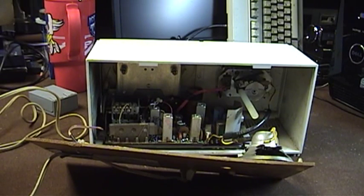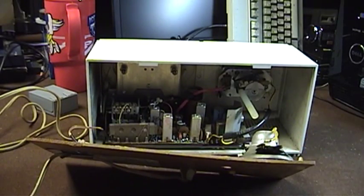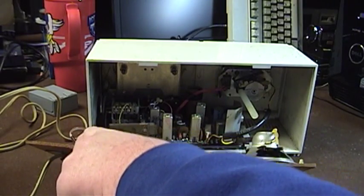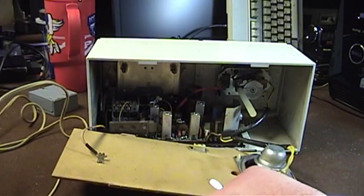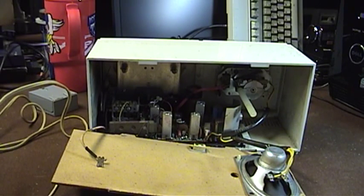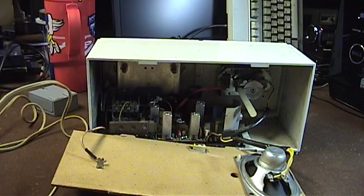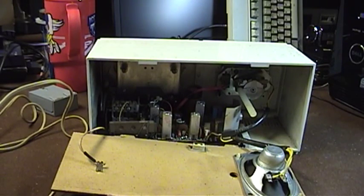I'm back, and I have just finished removing the rear cover of this radio. You can see the speaker stuck to the back here along with the plastic rivets that hold it in. You can also see the lead running over to the FM antenna that is ultimately attached via loose coupling to the power cord. RCA did not go out of their way to make this unit easy to put back together — getting the tabs to engage in just the right place and the power plug back onto its mating pins on the circuit board is quite a delicate ballet.